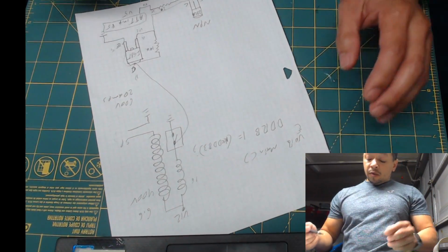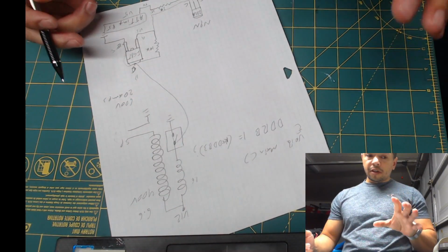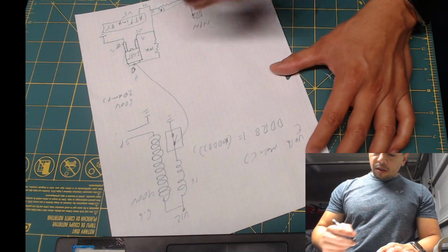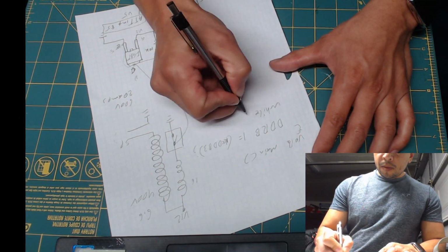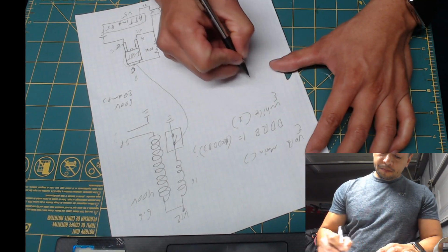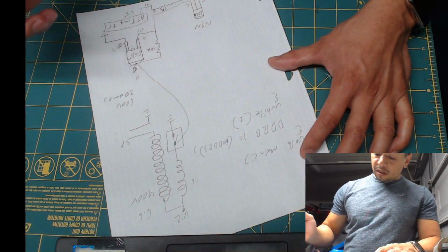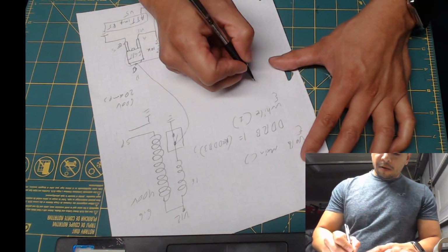Now, we want to keep switching it on and off, so we have a continuous firing of the spark plug. So we need to add a loop just to continue firing. Inside this loop we're going to start by turning the transistor on, so this one turns off. The way we do that is we specify port B on pin 3 to turn it off.